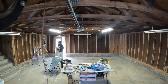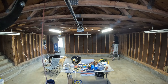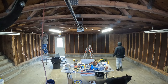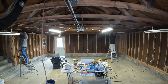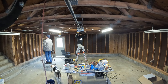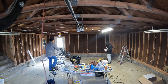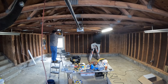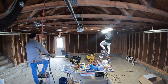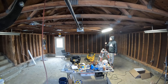Here I start running the wire from the breaker box to where the switch will be. Then Tom comes over and says don't do that, let's install the lights first, let's hang the lights first. So here's us hanging the lights. I really like these lights, they're easy to work with. They can go from a truss span of 14 inches to 24 inches. The rails slide and you can position the lights anywhere in between. They support up to a 75 watt bulb. They also support one easy plug-in connector, as I'll show you guys how to wire those up later. They support power in and two out, so it's easy to connect a bunch of lights together.